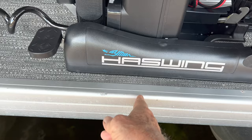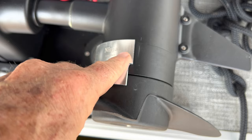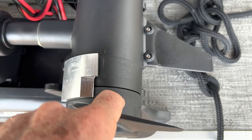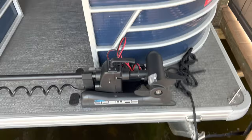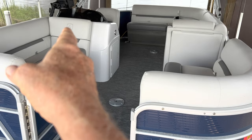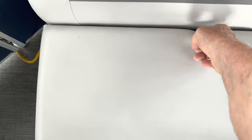I'm thinking the bracket goes about here, and with everything taken off, the XB bracket by itself is not that obtrusive. Another thing I've added is the Ninja weed and grass cutter — it cuts weeds, milfoil, hydrilla, and lily pads as the prop turns and they get caught up. It's very effective; watch the YouTube videos. The motor weighs 40 pounds and the battery 66 pounds, so call it 110 pounds on the port side. With one 150-pound passenger driving, it's pretty evenly balanced. I've also run a wire from the troll motor battery underneath the boat in a corrugated plastic tube all the way back to where I have a NOCO 5-amp two-bank charger.